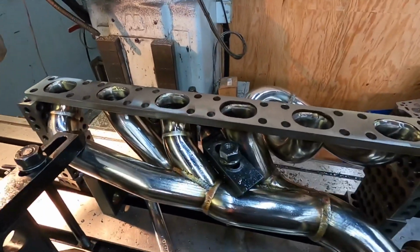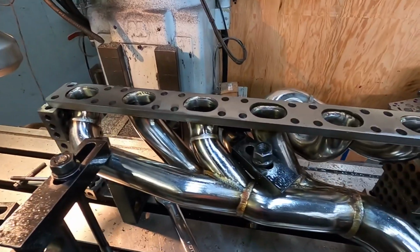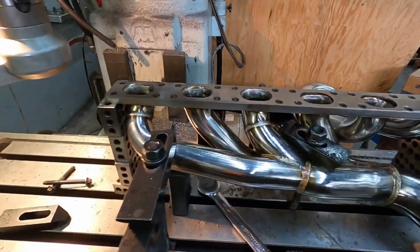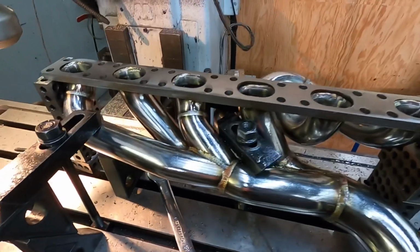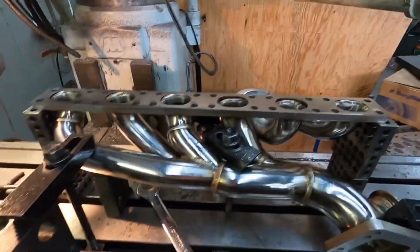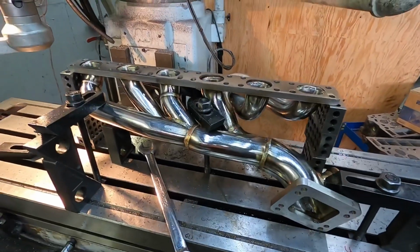After I got it jigged, I'm about close to an hour machining it off, because you can't go real aggressive on this. If I could put it on the surface, you could go a little bit more aggressive, but just the way the manifold is set up, you can't do that. Well, you could if you made a jig for it, but making a jig for one manifold doesn't make sense. But anyways, that's what it is. This one's just showing surfacing a manifold.